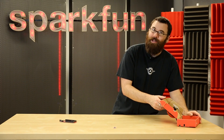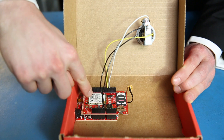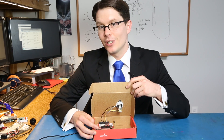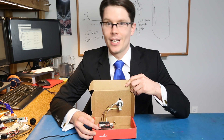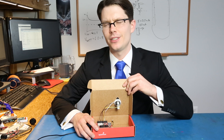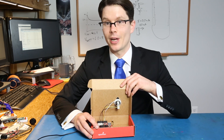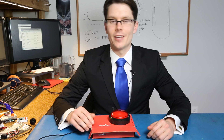Sean's got a little demo prepared for this, so let's see what that looks like. I made a button, and this button is attached to our new MG2639 cellular shield. When the Arduino boots up, it configures the cellular shield — which contains one of our prepaid SIM cards — to attach to the local cellular network. It listens for this button to be pushed, and once the button is pushed, it sends out a text to everyone on a list inside the Arduino. You can use this to send for help, call all your friends together, whatever it might be. The cellular shield also contains the ability to do voice and data, which means you can use it to get an internet connection even if there's no local Wi-Fi. The MG2639 does contain a built-in GPS, so you could use it to send your coordinates if you're pushing the button to call for help. For this project, I'm just sending a text to our support team if I need help with something.